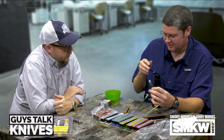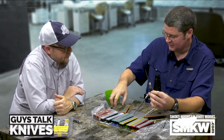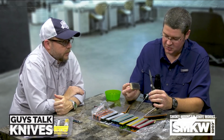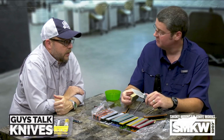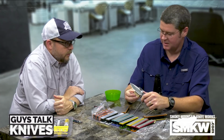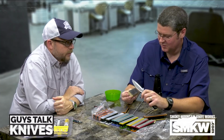So how does that happen if you're not sharpening it? You hone it. And like we talked about with the strops, this is my personal one that I carry. To strop, you want to find your angle, just like we did before. So here on the wood, I'm running it down, lifting it up until it bites. Okay, so it bites here. I want to keep about that same angle. I'm never going forward. And this is, again, one of the worst things you can do.